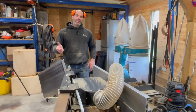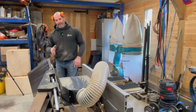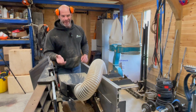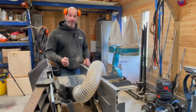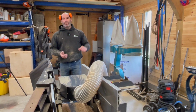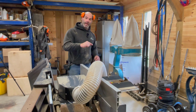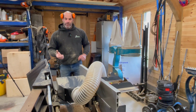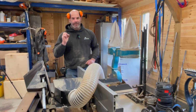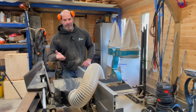So previously we were pushing the pieces of timber across the top manually. In this configuration, it self-drives. It will drag the pieces of timber through. Because these are quite big and heavy and a little bit wet, sometimes you have to give them a little helping hand, a bit of a shove, but this will now reduce them all down to the same thickness in both dimensions using the first 2 sides as datums. Once we've done that, we've then got all the knee brace blanks exactly the same size in all dimensions. The accuracy increases.